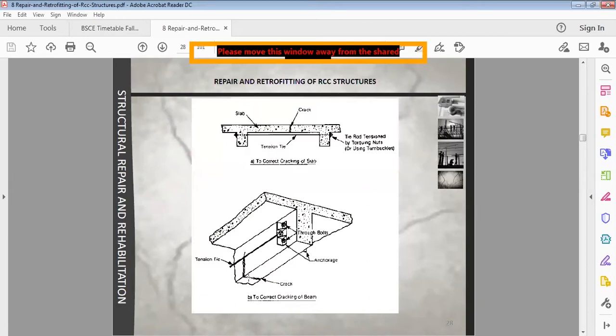For example, where there is a crack developed, to exert a compressive force across the crack, we provide a pre-stressing strand. We apply a tensile force to the strand — pre-tensioning it. After the steel has elongated and is released, it compresses the concrete, subjecting the crack to compressive force. The crack will then seal. This is the second approach of additional reinforcement to repair the crack.